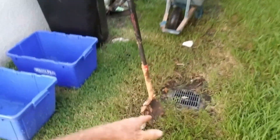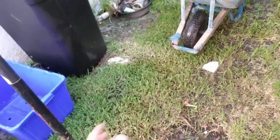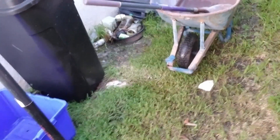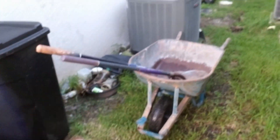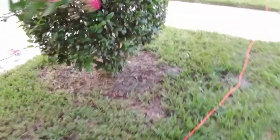You can see the catch basin here, and there's another catch basin on the other side of the AC units. You can see where it's been flooding here all the time. I was able to send our drain cleaning machine and open this line — it does flow, but it's uphill as it goes out to the street. So we're going to dig a sump pit right here, put a Zoller M53 in, and then try to actually pull a pipe through the existing pipe, which runs all the way through here. We'll pull that pipe all the way through and see if we can save these people some money rather than excavate through all that roots. That line comes all the way out to the old existing pop-up right here, and we're going to go ahead and try to clean that line first and see if we can pull that new pipe through the existing pipe.